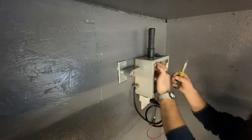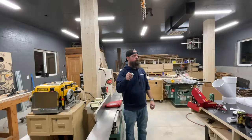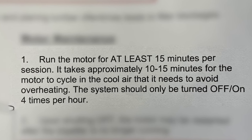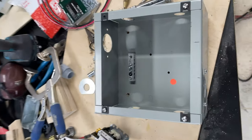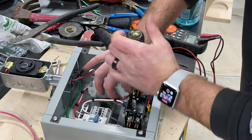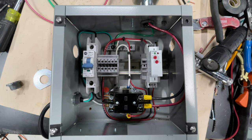After spending a couple weeks installing all the ductwork, it was time to wire this unit up. I started by installing the control box in the upper corner, but after getting it wired up I decided to make a couple modifications. This unit turns on and off with a wireless remote, and having the box tucked behind the filter worried me about potential interference, so I relocated the wireless sensor to a more open location. Having a background in the electrical industry, I know larger motors don't like to be cycled on frequently - the manufacturer recommends no more than four on-off cycles per hour. So I designed a time-delayed circuit incorporating a time-delayed relay that forces the system to run for a minimum of 15 minutes.